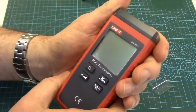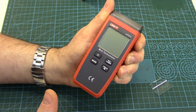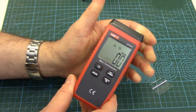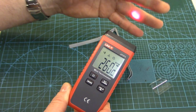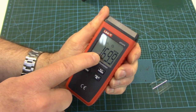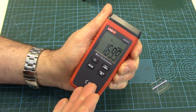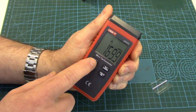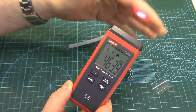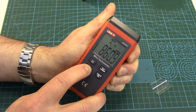Let's go over the button operation. Most of these buttons have dual purpose. We'll turn it on with the power button — it does a display check on all the digits, and when you first turn it on you can see the laser is firing and it's giving an RPM reading. If you hold the power button in for a couple of seconds you'll see a timer icon; that turns the auto power-off off. Probably don't want to do that, as leaving the laser on will drain the batteries fairly quickly. The mode button switches between regular RPM checking and recalling the maximum or minimum recorded value.